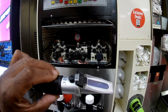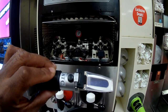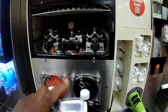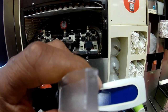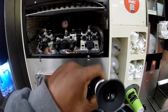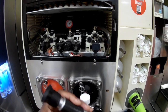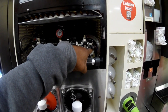You take a reading of the mixture with this refractometer. This refractometer reads the sugar-to-water ratio. Usually on sugared items you would want to have between 13.5 to 14 as your target number. You just put a sample of the product on this plate, the glass sight glass flips up, put your sample right on the blue, then close the sample plate. You take a reading from the scope and you'll see the number — that's your ratio — and then adjust accordingly.